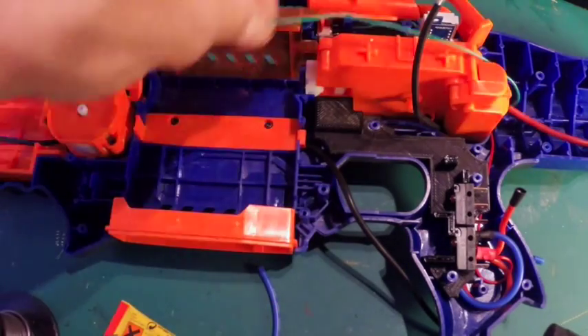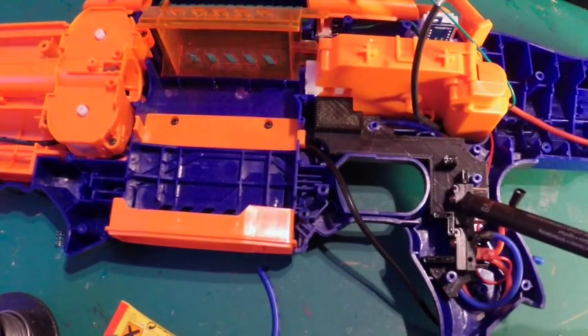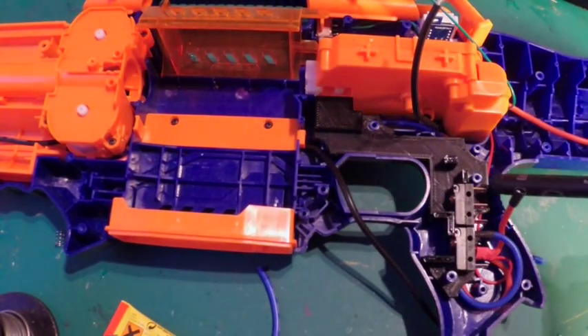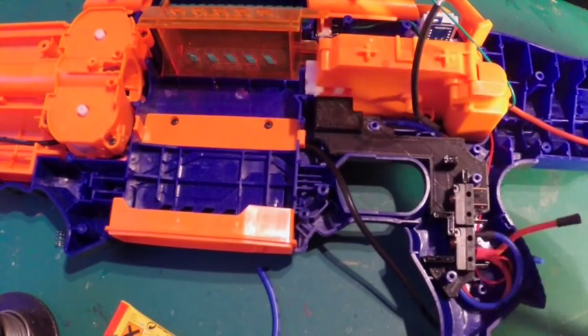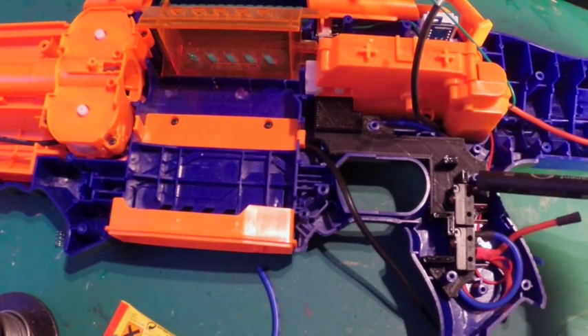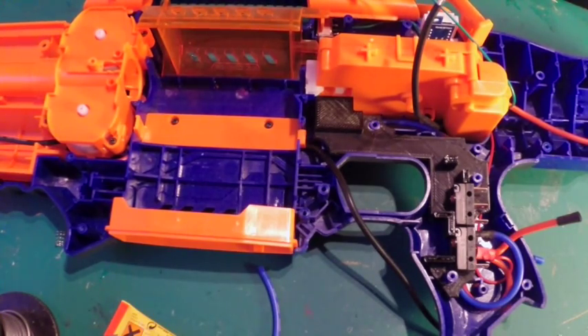There's the neutral - that green wire is the neutral for that which I'm keeping out of the way at the moment. I've just bonded in the next microswitch so we're going to make the first connection which will be the common. What I'm going to do this time to make my life easier is work from top to bottom because then I can work out my wire spacing. So we've got another couple of bits of wire to cut and then we'll come back and attach them.